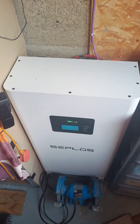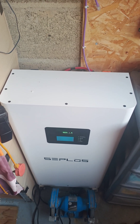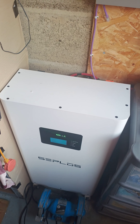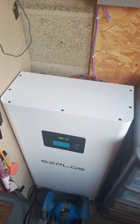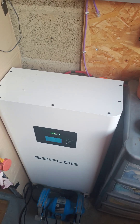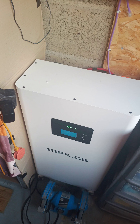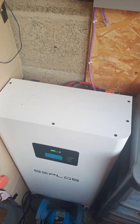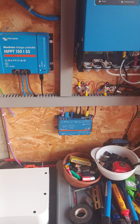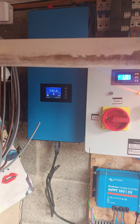It's too early to say anything definitive about this battery — it's maybe a few days working. It came as a kit and the manual is available on the internet, but the complexity of the internal wiring is not very clear. So far it works well. I haven't linked my laptop to the BMS yet; I'm waiting for an RS485 to USB converter to do the final adjustments. However, you can do a lot with the MultiPlus settings in the meantime.